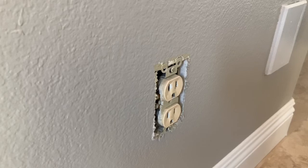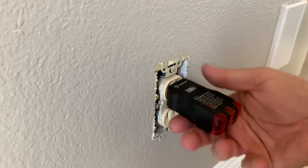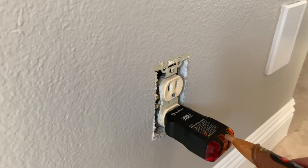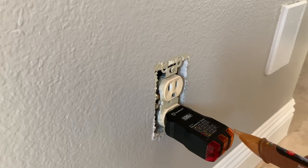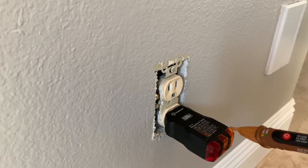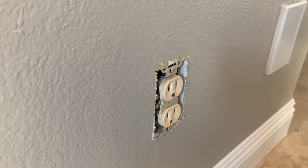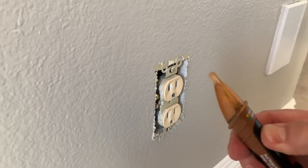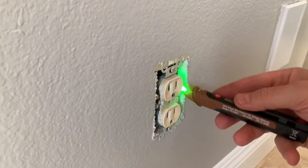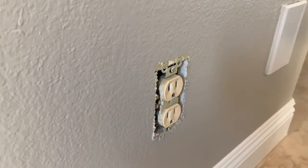For outlets, I've got the breaker off but I always want to test to make sure power is off. It is off. If the power were on and wired correctly you would see the two lights here — the center and right — light up. Otherwise you'll see a different configuration. Alternatively you can use this type of detector: it comes on with a light and will make all kinds of buzzing and squealing noises if AC is detected. There's nothing, so we're safe.